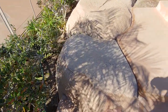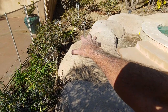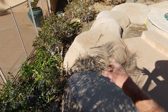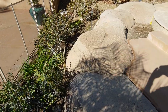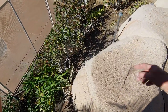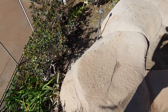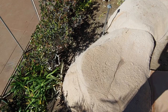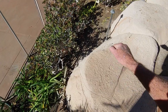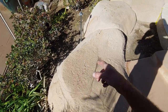The rock came out pretty cool. This crack right here — this whole chunk came off, and that whole side right there came off too. It was probably 150 to 200 pounds. A whole chunk came off, along with some other areas all the way across. So we took the pieces we could use and put them back in. We scratched and scored both sides — the rock piece that popped off as well as the surface it was going to be reapplied to. We mixed up a high-strength, fast-set mortar mix with a little spec mix to make it thicker, put it in, and tapped and vibrated it. There were big holes going quite far in some areas, so we got that dialed in.